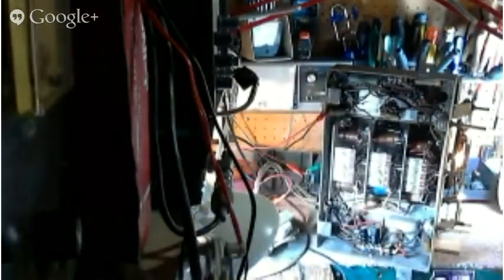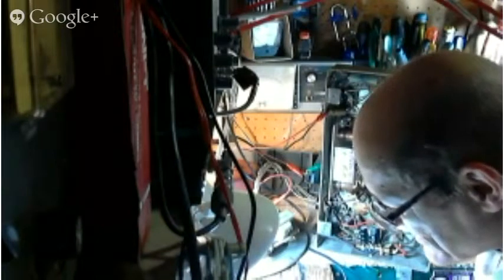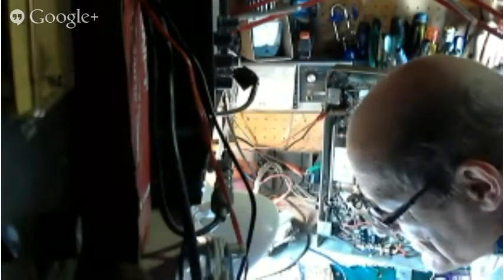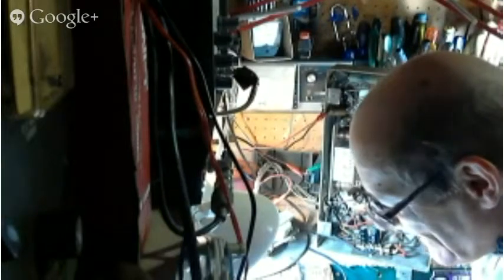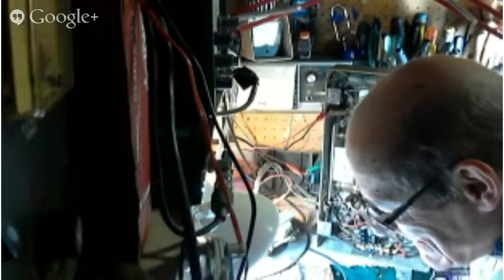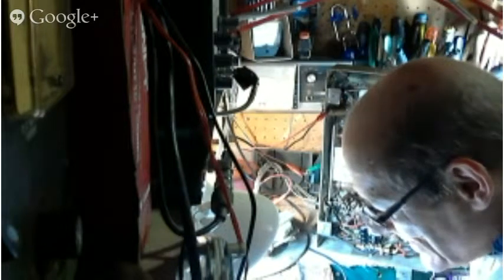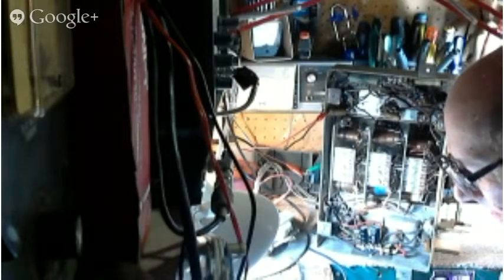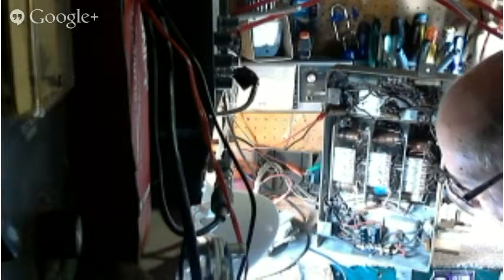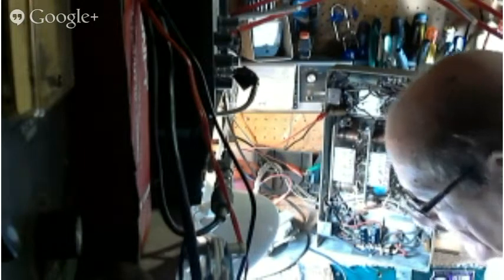Read the alignment instructions. Set the service oscillator to 456 kilocycles. Connect the lead to the grid cap of the converter to adjust trimmers C8P, C8S, C9P, and C9S. So 8 and 9 show up. C is capacitor. What is P and S? Boy, I'm drawing a blank. Now these terms S and P are used all over the place, so I better figure out what they are.